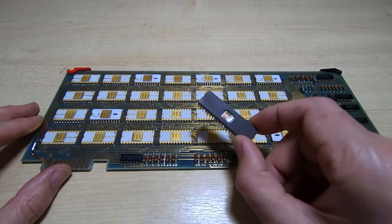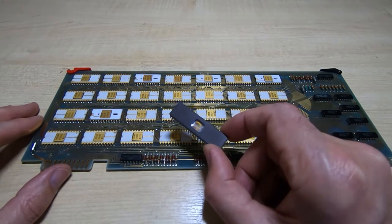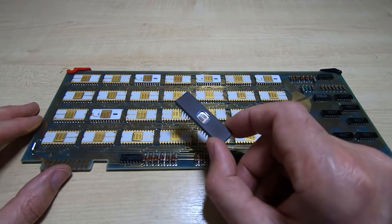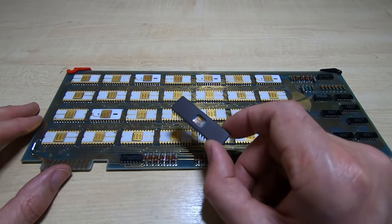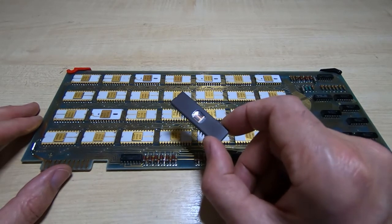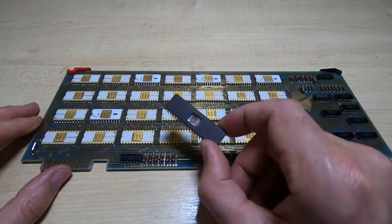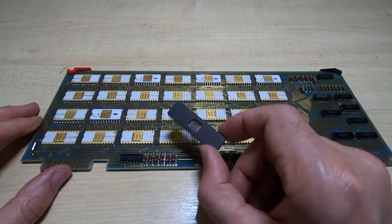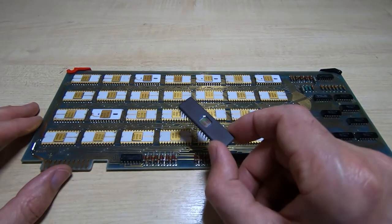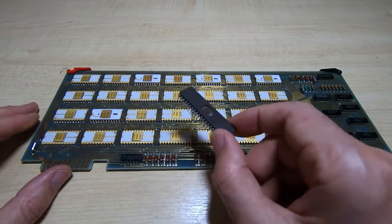This is very different from a tri-state output such as you get on an EEPROM. Although in tri-state the outputs are effectively floating, so you can pull them high or low with no real current sink or source from the device, you would run into a problem if the device is accidentally enabled when it shouldn't be. Tri-state outputs when enabled will actively drive the output high or actively drive the output low. If you have two devices connected doing that, something's going to get damaged — if one card is trying to pull the line low while this is trying to pull it high, something's going to give.